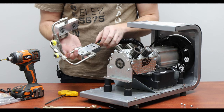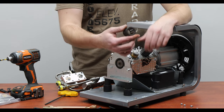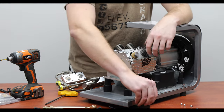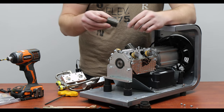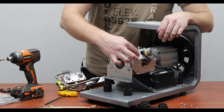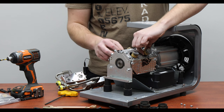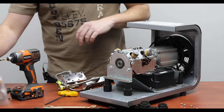For further cleaning you can disconnect that piece and get inside both heads. I can pull these cylinders right off — there's nothing holding them on. There are some shims underneath them, so pay attention to where those were and put them back exactly how they were. We do have replacement shims if they are destroyed or dirty. These are my pistons — I have four pistons, two on each side. You can see they're kind of dirty on the sides from grease. You can feel your connecting rods, and if those bearings at the bottom of the connecting rods are very loose, you will need to replace the entire rod.